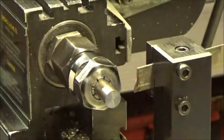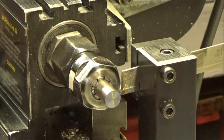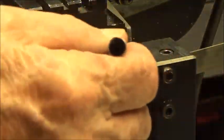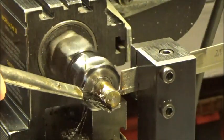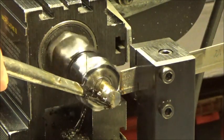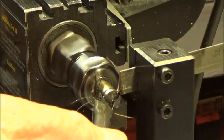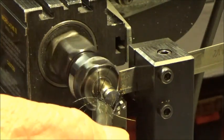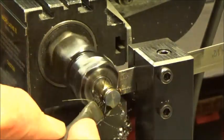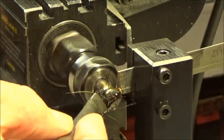I'm going to lock the carriage here. I'm at least half to three-quarters of an inch out on this piece of metal, which isn't ideal. I'm using a regular normal-size cutoff blade — I guess it's about 60 thousandths. There's absolutely no chatter. I'm theoretically making the cut, and cutting from this direction is probably a better situation than cutting from the other side as we normally do.